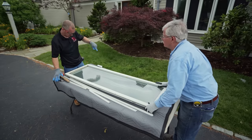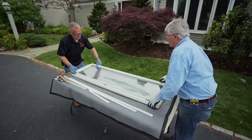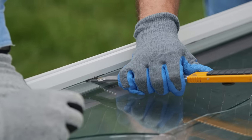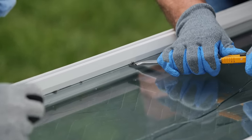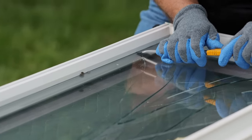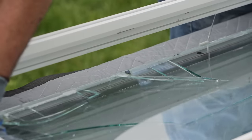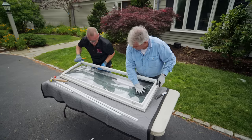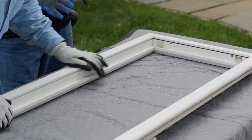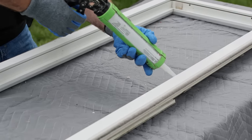So the next step, we'll have to roll it down. Just watch out for the broken glass. So we've got to cut the seal there — in between the vinyl and the glass there's a silicone joint, so we just use a very thin knife and cut right through it.